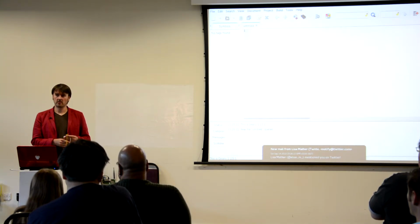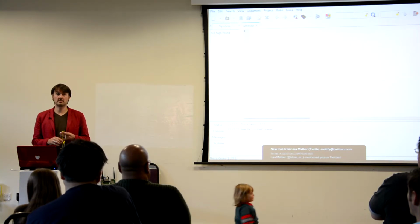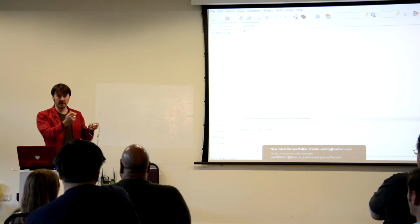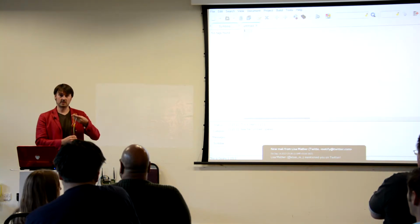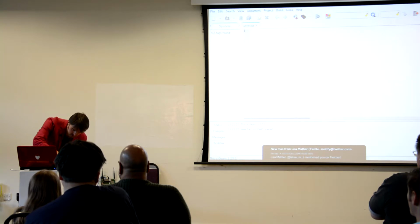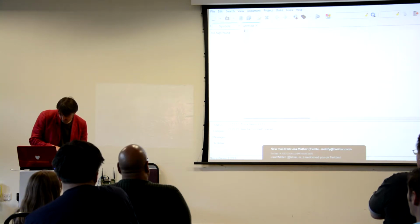That's the 400 points. We've worked with Beta to get the DTR pin soldered onto their CP2102. It's a much cheaper alternative than the FTDI, which people have been using. They are now shipping the new CP2102 and 2104 with the DTR pin soldered on. You need that so that the reset signal can get sent through to the Arduino, and so it will program properly. So, I'm suspicious that it won't. It's been flying around in the bag. Let's try. No.